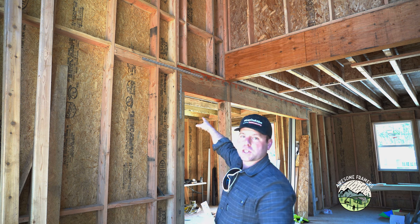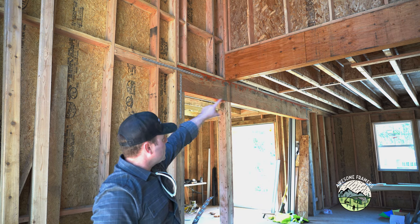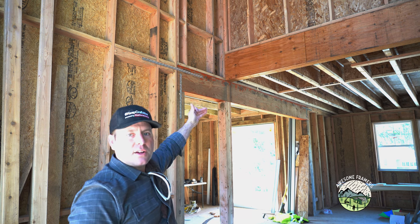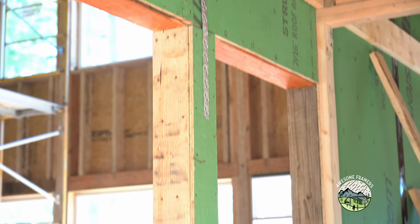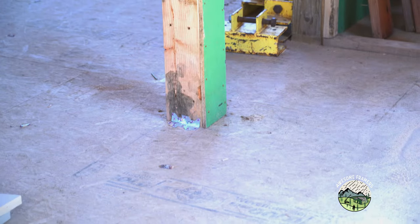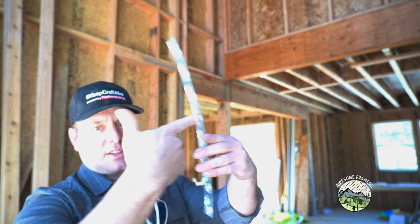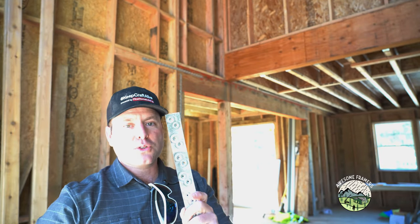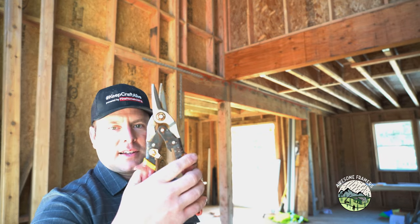We've also connected it vertically to the column. On the opposite side, the column that lands right below these two LVLs — the upper wall is strapped to the LVL, strapped to the lower LVL, strapped to the column. The column goes to the ground where it gets a piece of hardware so that it doesn't move in the case of an earthquake. All of that was made much simpler by using the coil strap — just shoot standard framing nails with a standard framing nailer. The only special tool you need is a pair of snips.